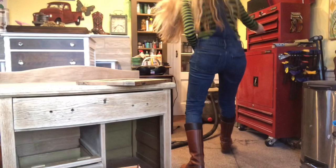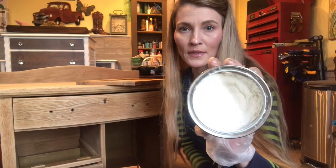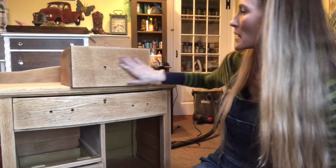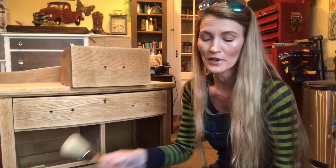So we're just going to open up the lid here. I'm just going to use my screwdriver. So it looks like this — very pasty. I'm going to set my drawer up here so you guys can see me apply it. You want a piece of wood that has a lot of natural wood grain going across the whole piece of it. That's where liming wax works most effectively and you're going to get that wood grain to really take it all in.